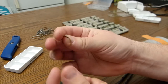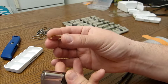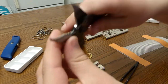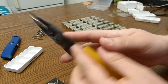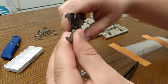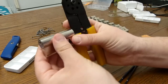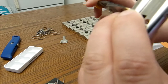I've got some new ones on order. I just want these to be perfect for the locks. For this I've made myself a new plier — this is the standard electrical plier, the cheap kind, and I ground it down into a nice lip. It works great for putting on the c-clips or bendy clips. It still is pretty fiddly, but this tool helps immensely.